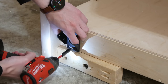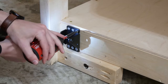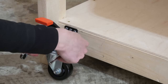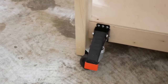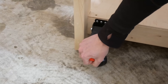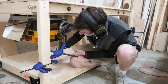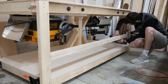At this point the workbench was too heavy to move around anymore so I added casters to it. I screwed in the base of the caster, then added the wheel by sliding a bolt through and adding a stop nut to the end, then repeated for the handle and tightened them both. These casters allow the legs of the workbench to sit on the ground, but with a push of the handles the legs lift off the ground allowing us to easily move a big heavy workbench around. Next I added 2x3s across the fronts of the workbench screwing them in with HD pocket hole screws. These rails just give us something for our flip-up tool panels to rest against.